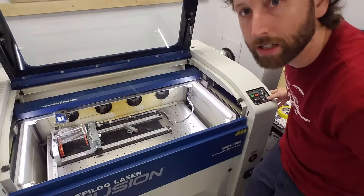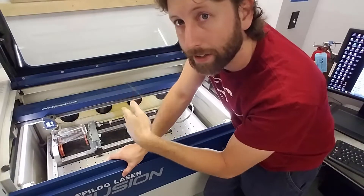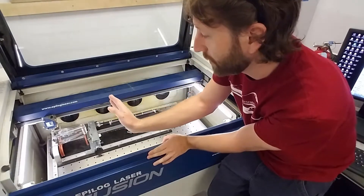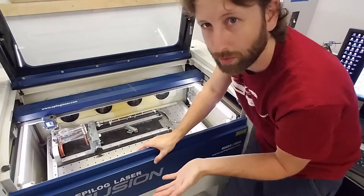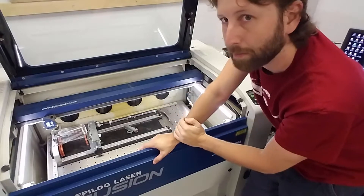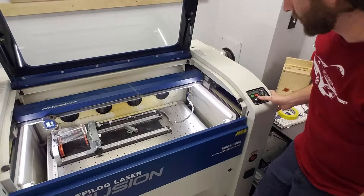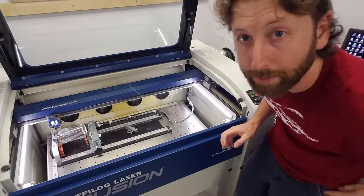Go to jog to set your offset. Where that black piece of plastic is, that is zero. The jog is locked on the y-axis — you can only jog x. That means the farthest-up point of the cup is where it's going to start — your home zero. Typically on pint glasses and most drinking glasses, I find that 0.8 inches is a really good spot that I use most of the time. So I'm going to set it at 0.8 inches.